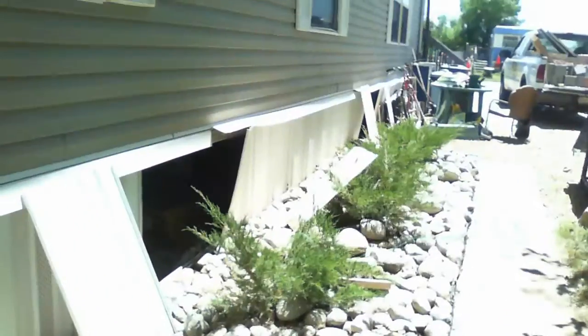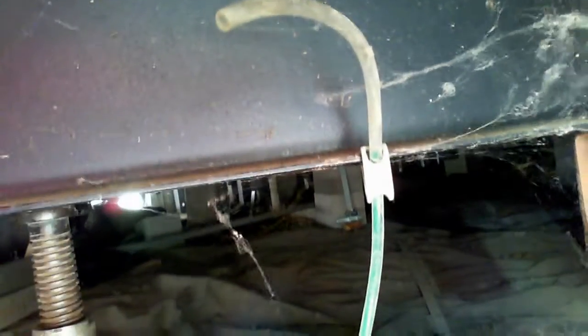As you can see, we've got the water leveler set up and we're going through. We found our high point — the high point is back here on the back left corner. So we're about to start going through and getting the entire house level with the high point. You can see right here as we're lifting, we have just a tad bit more to lift, but the goal is to get that water to meet up in the same spot along the entire mobile home.